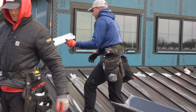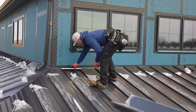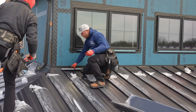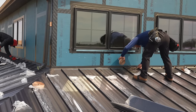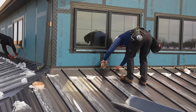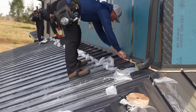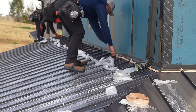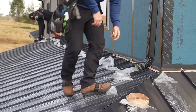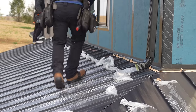We've got these trims that we just pre-made right here, and these are going to go on the panel to those marks that we just snapped. The double beaded butyl tape will go right underneath there — we'll screw through and it'll give us a nice watertight seal. It's important when you do this to make sure that your tape gets in along the edges really good, in these grooves on each side of the rib. We want a good seal so water doesn't get there, and also because the trims are cut to go in nice and snug.